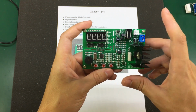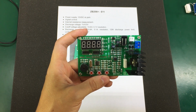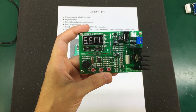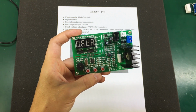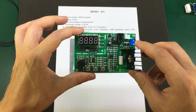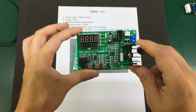The display will show R000, and if you connect a battery using 4-wire mode, it will measure and display its internal resistance. If you press the SK button while in this mode, the display will toggle between the battery internal resistance and the battery voltage. It features a bunch of error codes similar to other ZHIYU dummy loads.